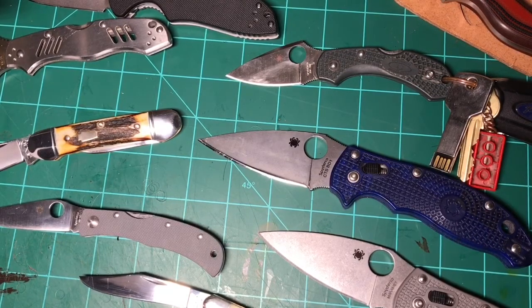Rockwell hardness is measured on the Rockwell C scale. I have an older Clark hardness tester that I was using. It's pretty accurate — not a $20,000–$30,000 scientific research unit, but probably about five to eight grand new in today's dollars. It's a big heavy machine and a little finicky at times, so these numbers are pretty accurate, within a point or so one way or the other. The knives are much further apart than a point or so.